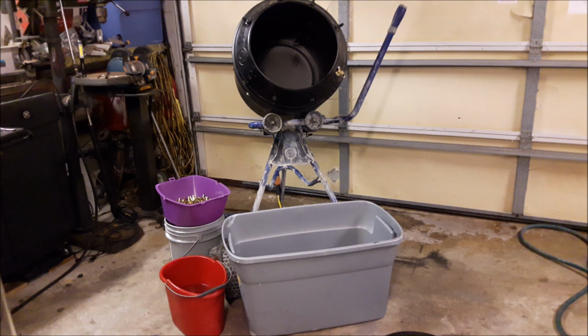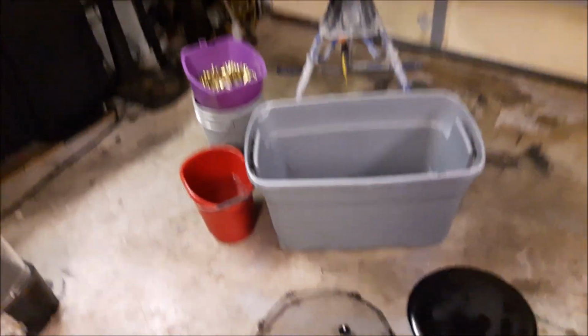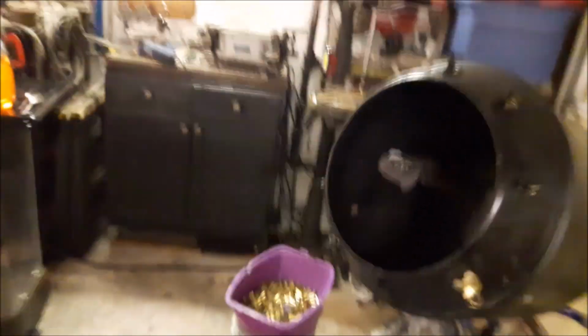For those of you who wish to do the same, adding baffles in your mixer, I recommend using license plates. You can bend them by hand, yet they're strong enough to agitate the mixture. If you aren't concerned with how the mixer looks, you can use self-tapping screws to secure them. I used 1/4-inch stainless steel bolts, which you can see there. These are leftover bolts that came off my Harley when I did modifications on that, which can be seen here.